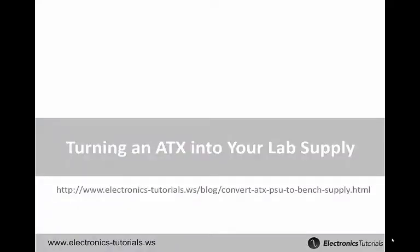Just about everyone has an old PC gathering dust in their basement or attic. The floppy disk drive may be useless, but that power supply — the so-called silver box — may still be good. As the web-based tutorial on Electronics Tutorials shows, an ATX power supply provides a whole host of different voltages and quite a bit of power. Also, take a moment and remove any fans you find in the case of your old PC — those will be great later for keeping your power supplies and other electronics cool.